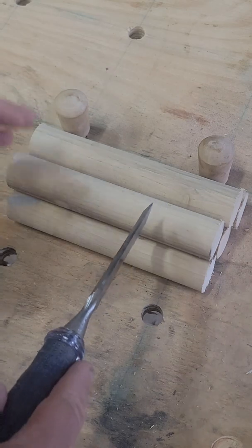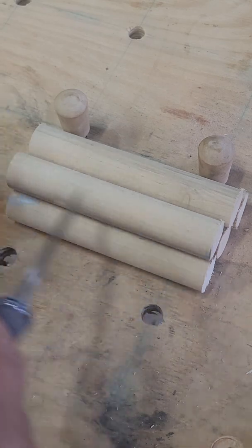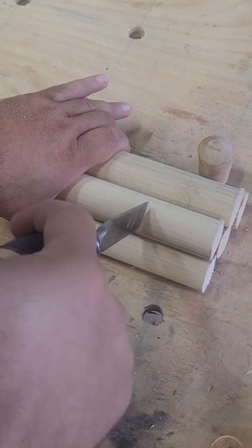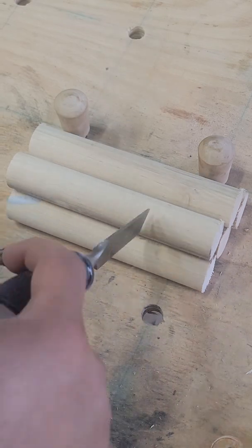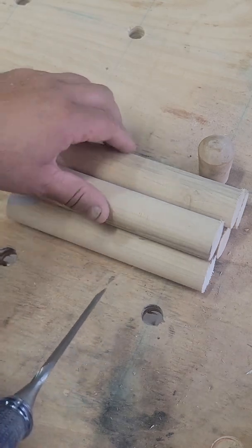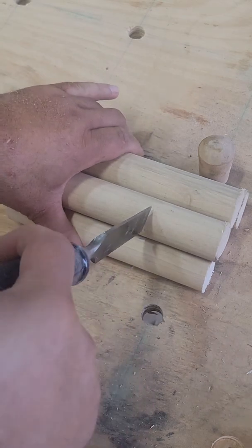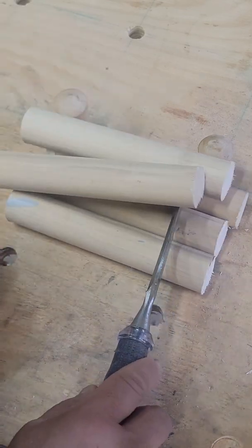When you are gripping this wood in a chuck, as you're turning a bowl, you need to think about what this grain direction could mean. For a very crude example, cross grain, if you are pinching or cutting into that, say with the dovetail joint of a chuck jaws, what you're doing is compressing those grains from the end grain. So if you're turning an end grain piece, so the orientation is lengthwise, you're going to compress that with a tenon in the chuck, because that chuck squeezes that grain together, right? If on end grain you had a recess, it would wedge it apart.